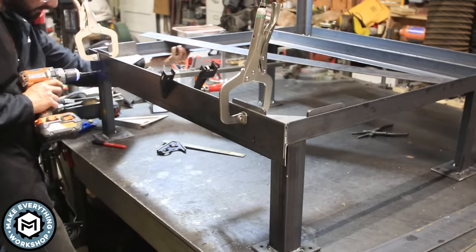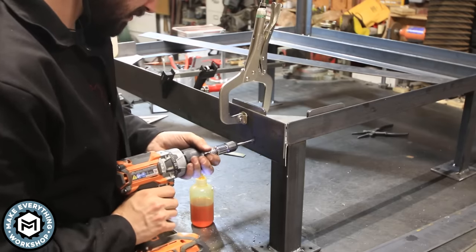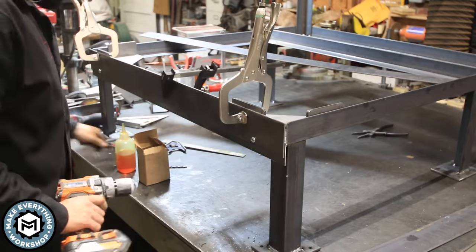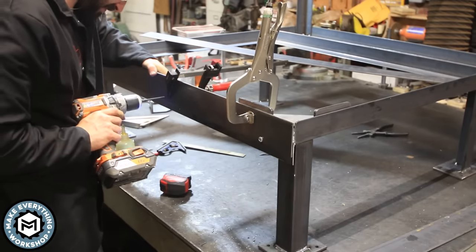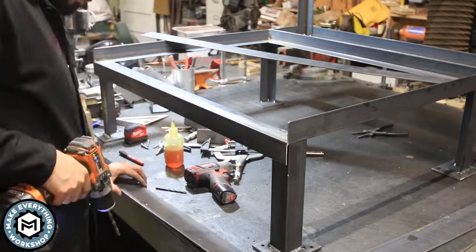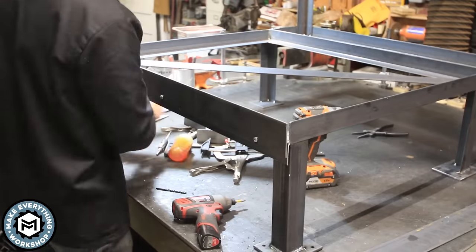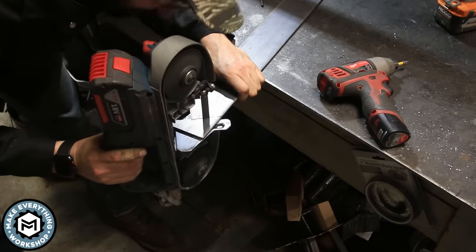I'm drilling in a piece of three inch by eighth inch plate on the front, going into the bottom side of the angle I spoke about earlier. Now I'm taking a tap and tapping a quarter-twenty screw tap inside that eighth inch angle plate. The reason is that when the ovens are on this, if they ever need to get to the front pilot light, they need to remove this front piece. On the other carts they already have in their shop, the fronts get all damaged, so I gave the client the option to drill and tap these — it'll make it so much easier for their guys. By avoiding nuts and bolts, it's really only one part they could lose instead of having to deal with a nut and bolt getting separated. With a Phillips head screw they can take this out whenever they need to service it. The other piece I'm adding is this crossbar — I just laid it across the top, traced it, and cut it with a porta-band, so the bottom of the oven can never fall out if it ever were to sag.